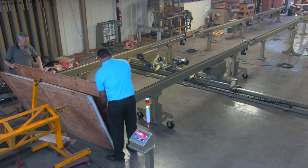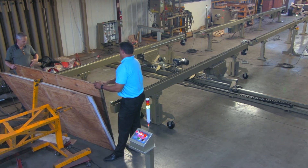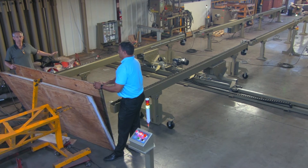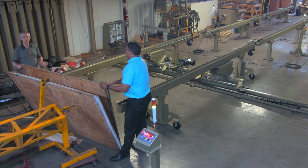There are two sensors on the in-feed end of each conveyor. The reason we have two is that if an operator walks between machines and accidentally waves his hand over a sensor, we don't want the conveyor to start. Both sensors have to be tripped within a second of each other to constitute a valid signal to start.